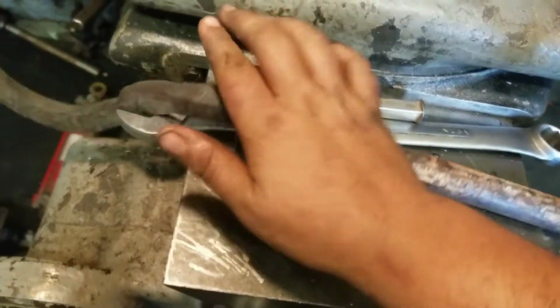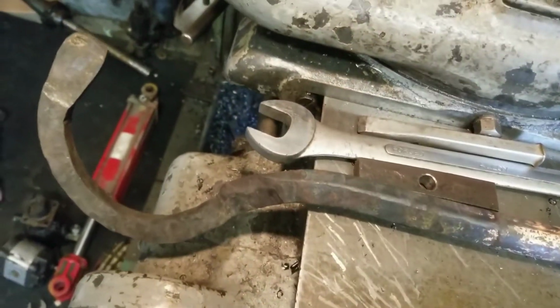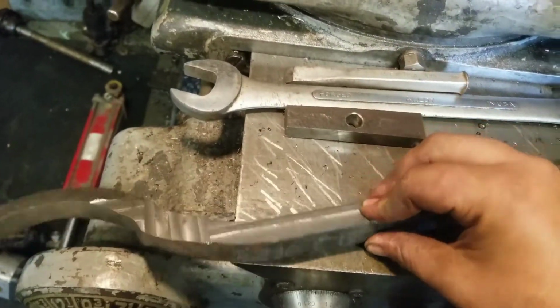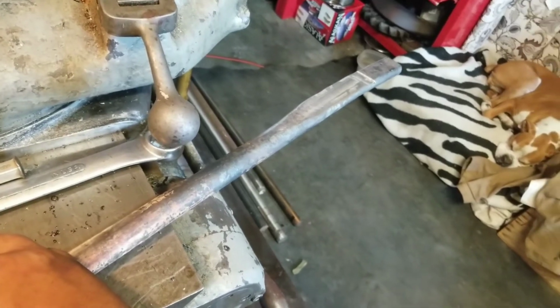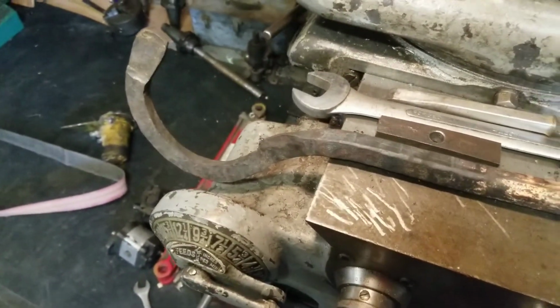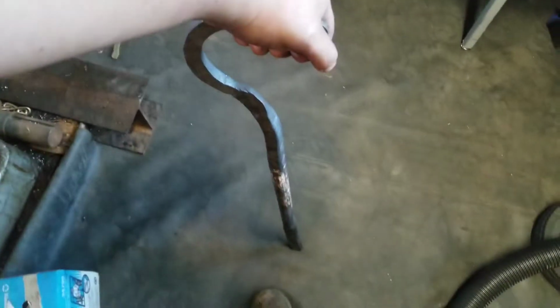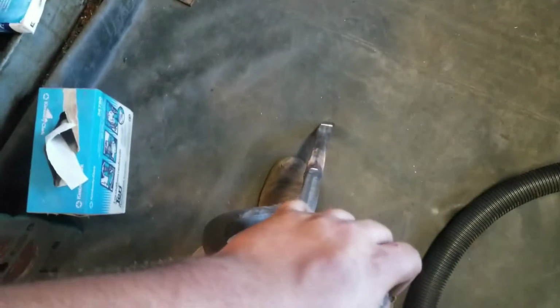This chunk here is going to be used to align the platen, so that it is perfectly square with the motor and the drive wheel. The idler is going to get a tracking knob, tracking plate, I suppose. Simple job, looks like a crook or a cane, but it's the frame for a new grinder.